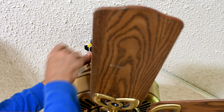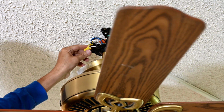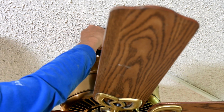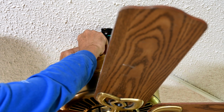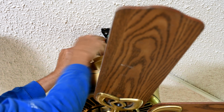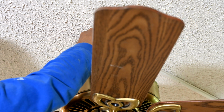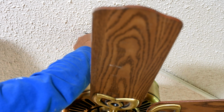But definitely you should have some type of voltage sensing device if you're going to be playing around with electrical work. Because don't ever trust anybody labeling the fuse panel correctly. I've never walked into a house and seen it labeled correctly. In fact, in this particular townhouse, I was helping them out doing some wiring of lights in the kitchen and found that the entire fuse panel was pretty much wrong, except for like the water heater and the stove, you know, the big items, but a lot of the individual circuits and lighting switches, they were all marked wrong.